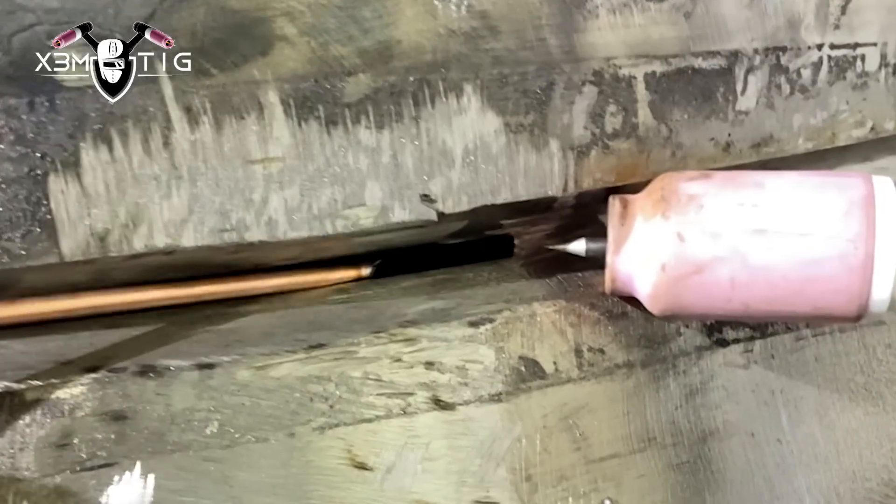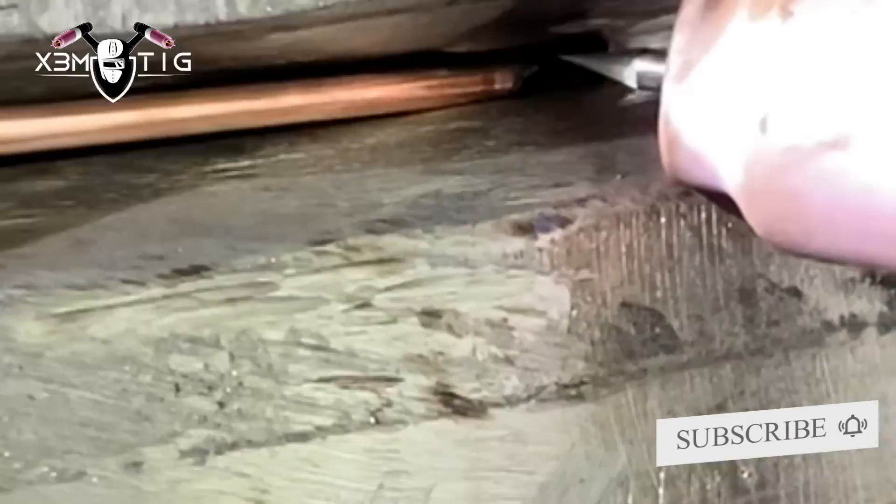That should be good, and half an hour to preheat. For the stop-start tie-in, I'm just going to hold that rod inside. If it's a little bigger gap I like to keep my rod inside the bevel, just dipping the tip of my tungsten a little bit — it's not a big deal, it's still sharp enough to melt the puddle and keep welding. As long as you don't dip too much or break the tip of your tungsten, you're fine. For this tie-in connection, you want to slow down and pause — melt bottom, melt top, adding wire at the same time, as needed. You just have to keep reading your puddle, watching what's going on. I'm running 140 so you don't want to pause too much.